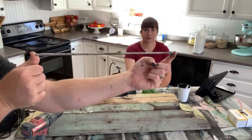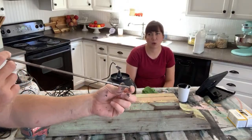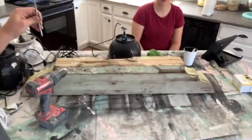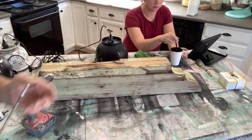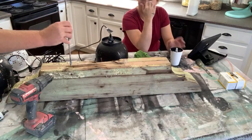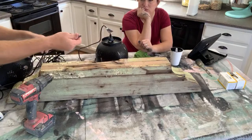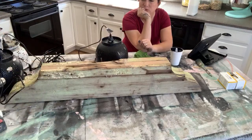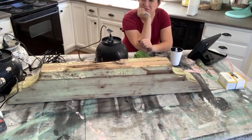This is a three-eighths spade bit that I use to drill long holes in candlesticks so we can turn candlesticks into lamps. I salvage porch posts and just run the electrical down through there. On this chandelier I would get the other kits so I could wire it directly into the ceiling. What I do is just run this down through wherever I'm going to put the lamp hanging, run the wire up through that, wire it into the ceiling, then hang it with correct support to a stud — this piece probably weighs about 35-40 pounds.